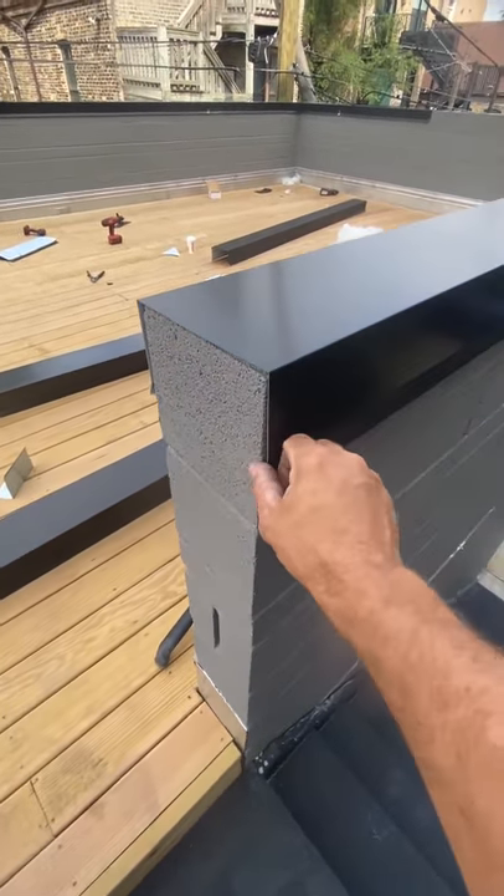The last thing left to be done — this should be covered with a seam cover. There are two types: one goes under, one goes over. I have an over one and I like it better — it looks better. First we have to do the caulking here. The seam cover is bent really well because it catches on the outside; on the inside it's a little open but we put a fastener there. We have seam covers on each seam and that's going to go really quickly.